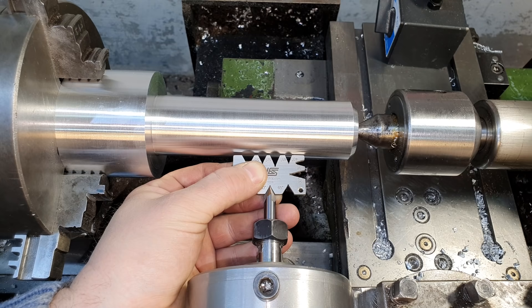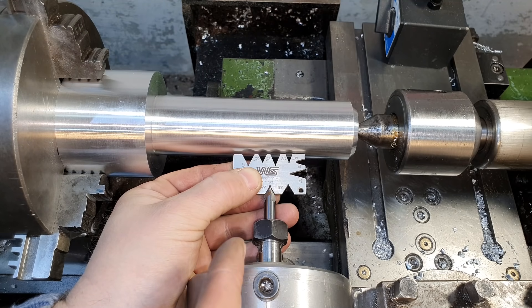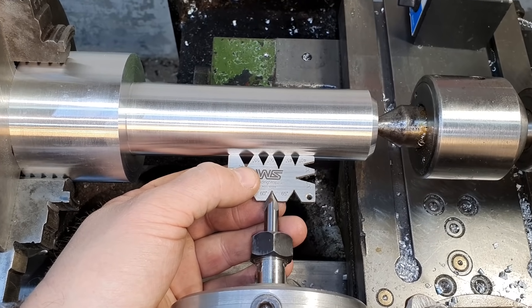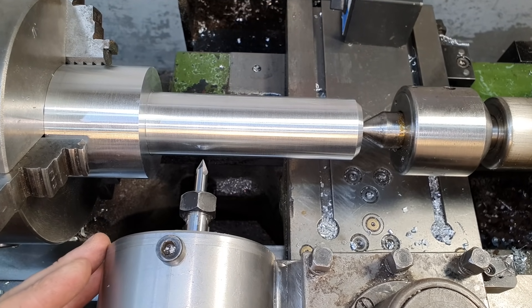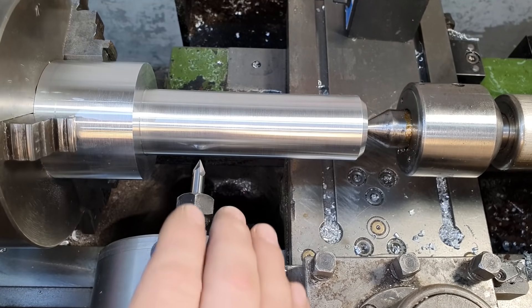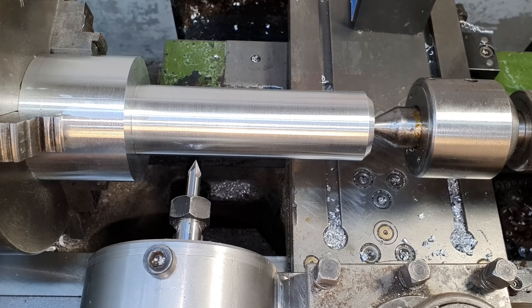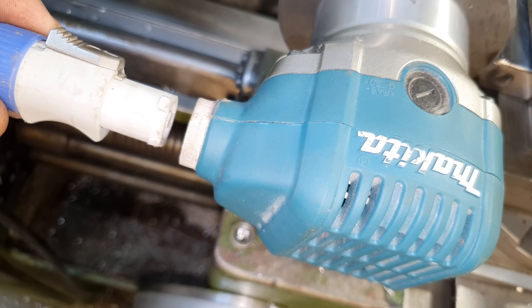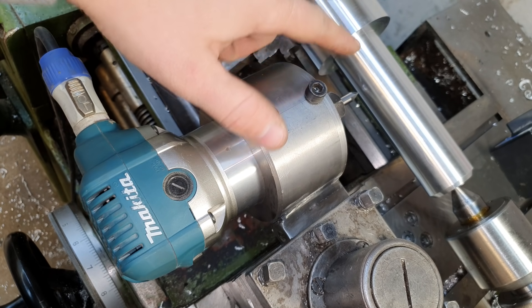The cutter must be very precisely aligned — just like a cutting tool when threading — strictly at 90 degrees to the rod. This template, also called a 'fish', will help me do that. Now, to know how deep to plunge, we need to make one more setting: with the workpiece rotating, gently touch the cutter to the surface and set the cross-slide dial to zero. We also need to make a relief groove for the cutter exit.